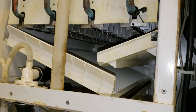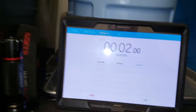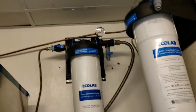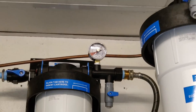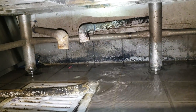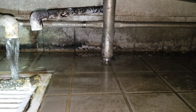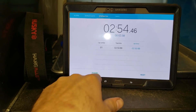Okay, we're going to flip this on. The moment this water valve turns on, we're going to start our stopwatch. Here we go. The black needle is pegging in the red. We're going to keep timing it until water comes out of that drain — as soon as it starts dripping out, we know we're at the five-gallon mark. That's it. There's our time. So now we can do the math.